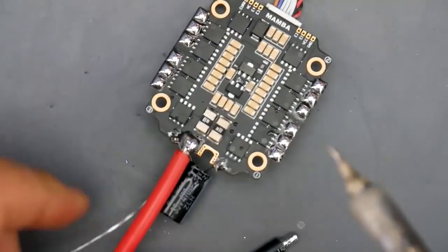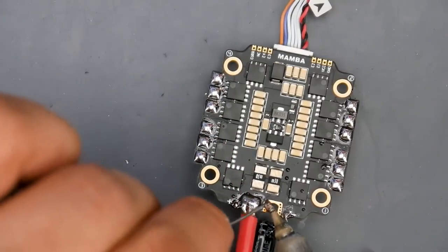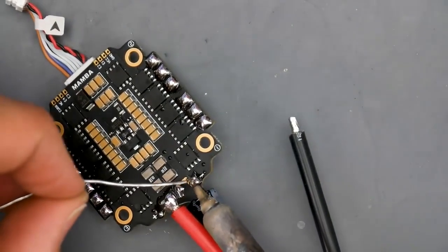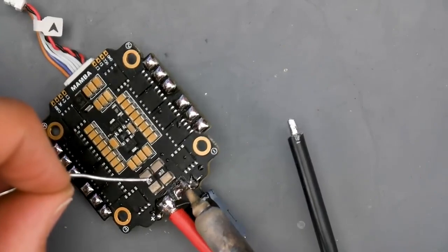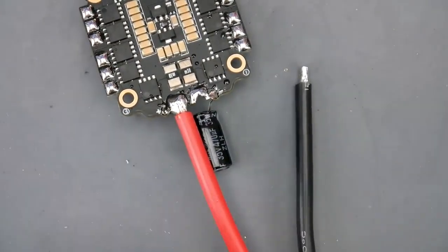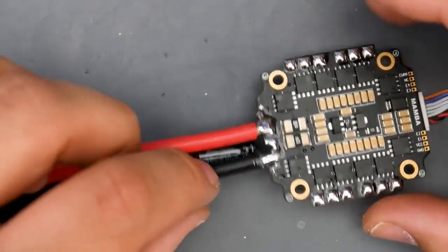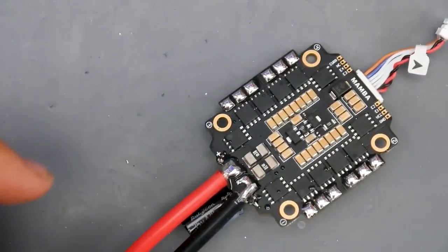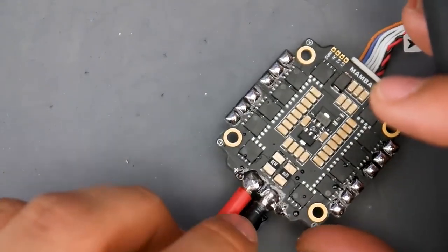This time I'm going to add a bit of solder on the pads, because again, the ground is the most difficult one. I highly recommend you try out the positive side first, because it'll be slightly easier than the ground, and it should make your life a little easier, or you can at least practice your execution for the next one so you have a better idea. The worst thing is to try the harder one first, and there will be a huge difference in the amount of time and heat you'll need to solder the ground side. So let's go ahead and figure this out here.